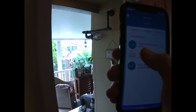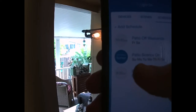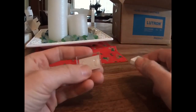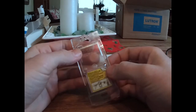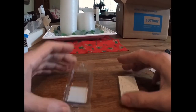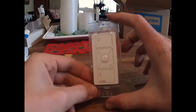Now that we've got our time clocks made, let's select them and verify that the load is acting correctly — just verifying that you programmed it correctly and the load is acting the way you want it to. One thing cool about these Pico remotes is they come with a tab on the back with a sticky adhesive. This tab is removable — you can stick it to the wall and still remove the Pico at will, or there are holes in the tab so you can screw it to the wall. In our case, we're going to use a Pico remote wall plate bracket because we want to screw a cover plate around the Pico remote to make it look like a real switch on the wall. Pry the tab off the plate, slip the Pico remote right onto its tab, screw it to the wall, and attach the cover plate.